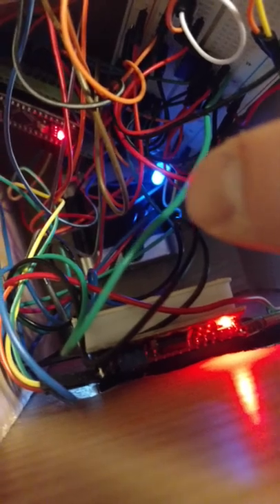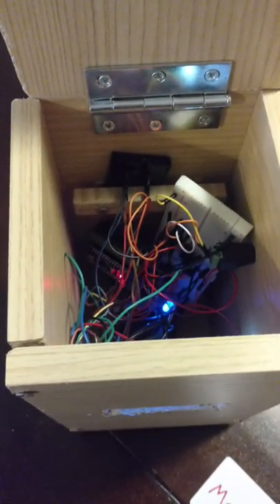So you can see in here — could be better, we have future plans to upgrade this — but we have an RFID sensor, ID-20A, just bought from SparkFun. And an Arduino Nano controlling it all, with a display as you saw earlier. Down at the bottom of the cylinder you can see there is a motor with a coupling attached to the key shaft. Power and user input is the RFID. And that's it.